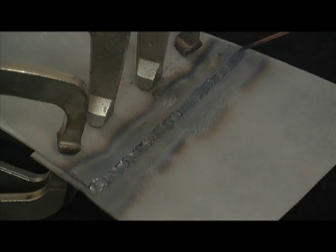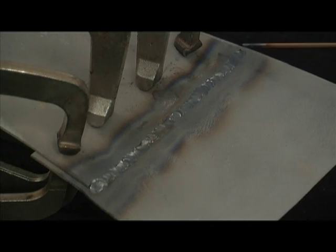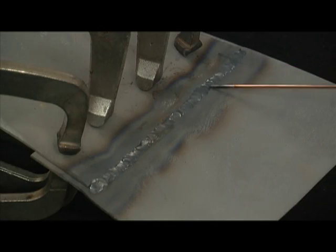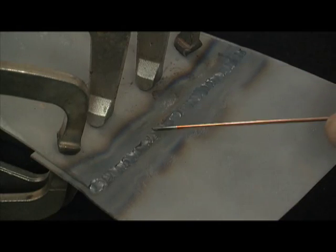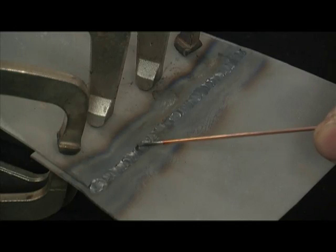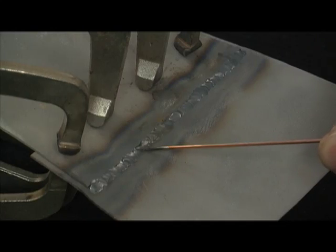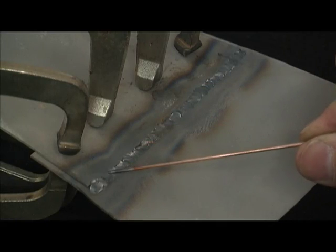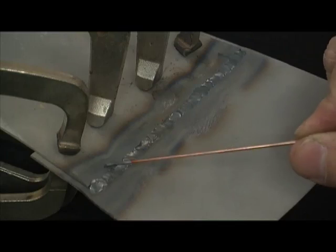When I first concentrated on my puddle, I got a nice even slope where the filler rod doesn't catch anything, which tells me that's a good weld. When I sped up a little, it catches slightly, meaning I didn't have enough filler material. When I sped up a lot, the filler is actually concave and catches a lot — I was going way too fast with not enough filler. When I slowed back down, it was a nice clean weld again with no catches or burrs.